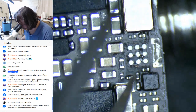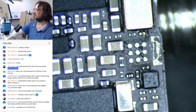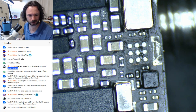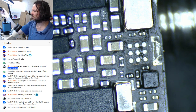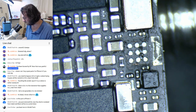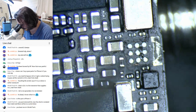I've got a theory that Apple is reducing the amount of underfill under these things because they want to be able to service them themselves and offer them back out as refurbished. Because if you compare the 4S, where they essentially drown the whole thing in underfill, to the 6S, where there's very little underfill at all, in comparison anyway. I mean, obviously things like the CPU and NAND have it, but for most of the other parts, it seems like they've given up. Or they've got a different construction technique that they like.